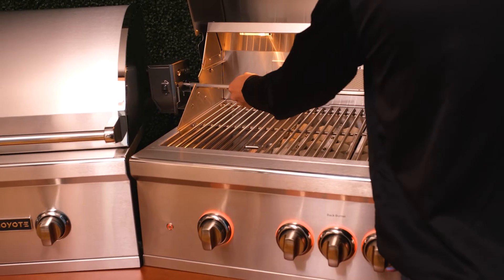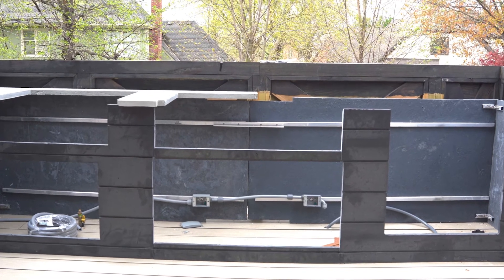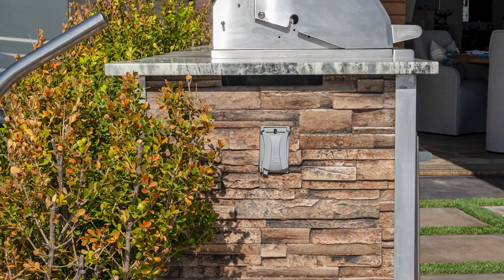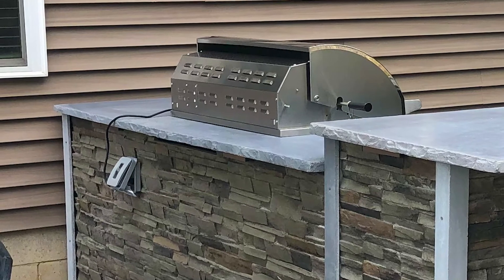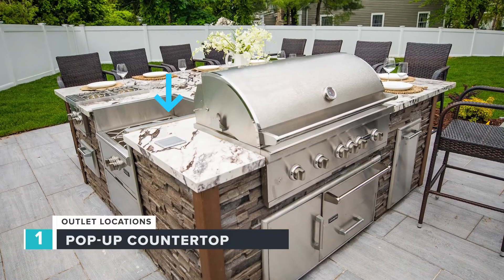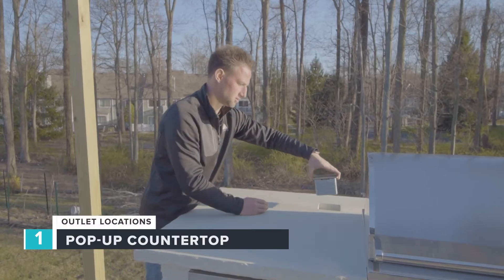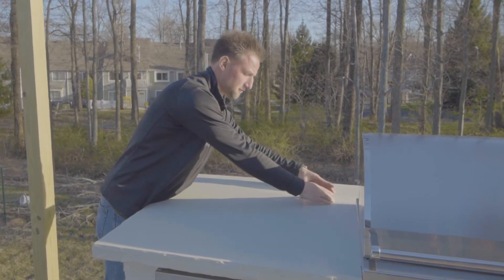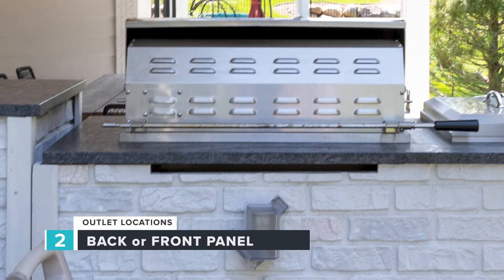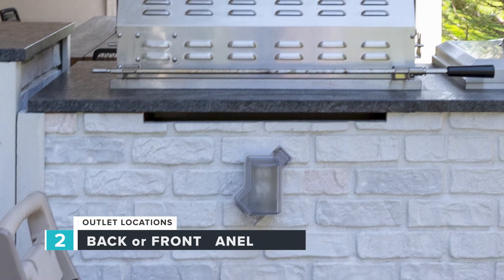The lighting requirements for an S-Series grill are a bit different. Coyote S-Series grills do come with a rotisserie attachment, so you would still have the interior lighting — it is recommended to have two outlets: one located inside the structure of the island to power the interior grill lights, and one outlet located outside the island structure that you can plug your rotisserie into. The rotisserie cord is only about 34 inches long, so it is best to have that outlet close by to avoid having to run an extension cord. One common location is a pop-up countertop outlet — if you have counter space available, you can locate a pop-up outlet to the left of the grill towards the back of the countertop. There are some additional costs for purchasing the outlets and making the cutout in the countertop.